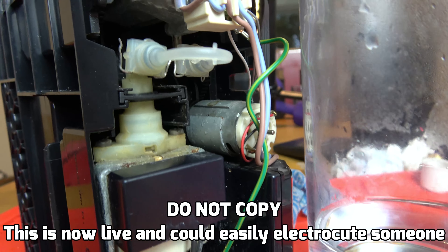We need to undo these U-shaped retaining clips from where the pump connects up to the water heater. There is a technique - apparently you can spread them out at the bottom and take them off - but these ones are being really stubborn so I'm trying to do this on camera. I think I'm just going to end up bending them and bending them back into shape. So I'm simply going to bend them straight, pull them out from the top, and then bend them back again to put them back on if we can fix it.